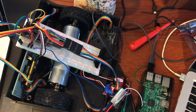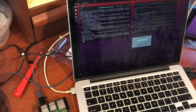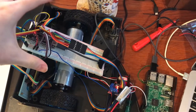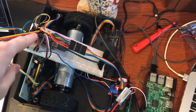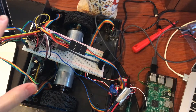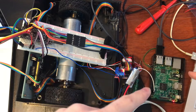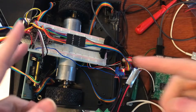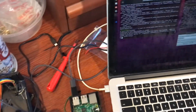I just got this working so it's kind of a mess, but I'm going to briefly explain what's going on and then put all this stuff into the robot box and have it drive around. There are two motors with encoders which tell the position of the motor, connected to this microcontroller which talks to the motors and encoders and can set the speed. I want to control this from my computer - this Pi has a ROS node communicating with the microcontroller, sending commands to move at a certain speed for each wheel and receiving the actual speed, and it listens for commands from this GUI running on this development machine, this laptop.